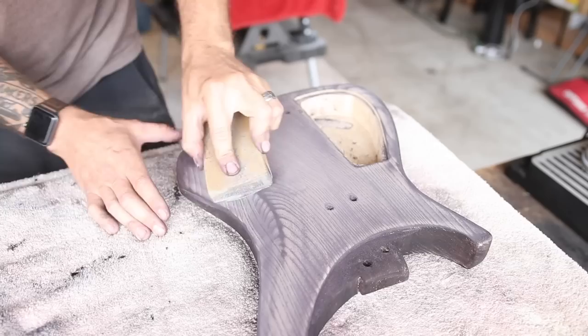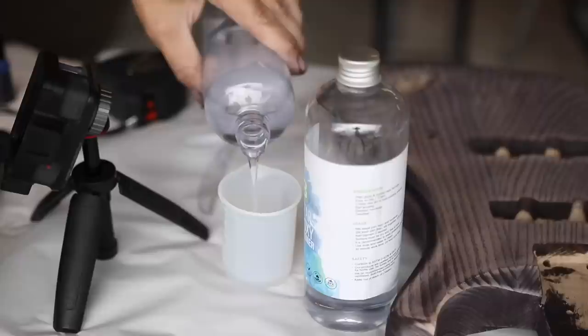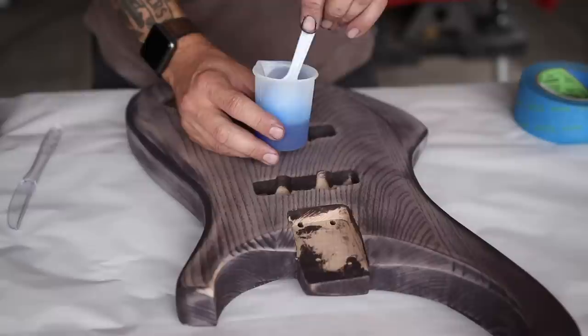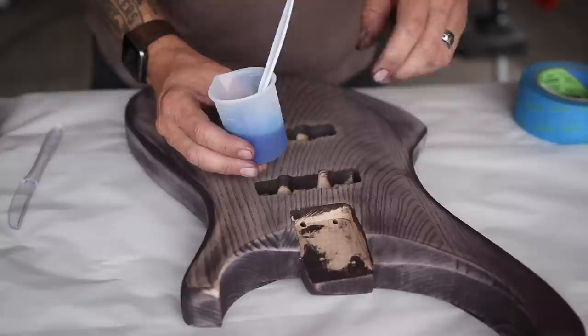My inspiration for this was that this Paulownia has such a nice, beautiful open wood grain and I really wanted to show it off. But Paulownia is extremely soft and it scratches and dents really easily, so I wanted to protect it really well. Once I'm done mixing up this blue epoxy resin, I'm just going to coat the whole entire thing — it's really going to make that wood grain pop and give it a nice little blue tint. I tested on some scrap and it didn't run off the edges, but who knows if that'll happen with rounded edges.